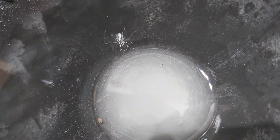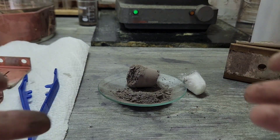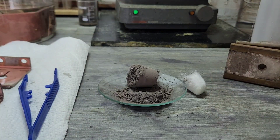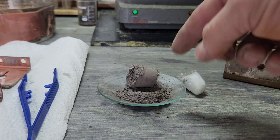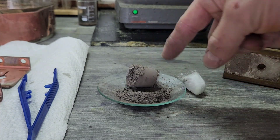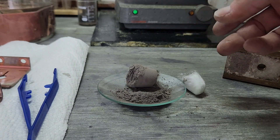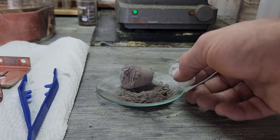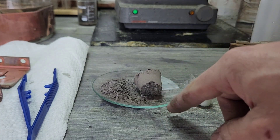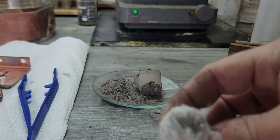Do a couple of distilled water rinses to make sure we've got all the HCl off. I completely forgot about this experiment and I'm not even sure I have the beginning video clips, so I'm just recording this just in case. The last part I recorded, these were in the filter — I poured out the AP and rinsed it a bunch of times with distilled water in a separate bucket to get as much AP off as possible, then let it sit for about three weeks until completely dry. You basically just pull that copper plug off — you still get a little fuzz there, it's not perfect — and there's a little silver in the plug, so that goes in the filter to recover later in the nitric boils.